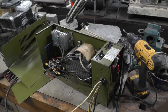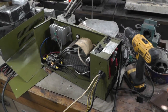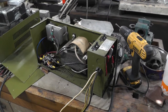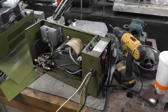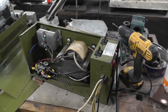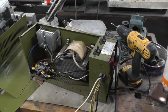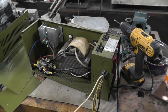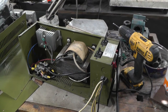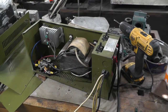We had a rainy day, so I dug through my collection and found a battery charger out of a camper. Somebody was trashing the camper and wanted to know if I wanted it 20 years ago, and of course I never say no. I had a hard time finding it because it was kind of buried, but she's an old school one — which is what I like anyway. Transformer based, no electronic stuff. If you plug it into regular electric it'll charge about 60 amps — it says it's 30 amps. These things never work well on a generator, but with a generator this one will charge about 30 amps, so it's going to be just about what we wanted.